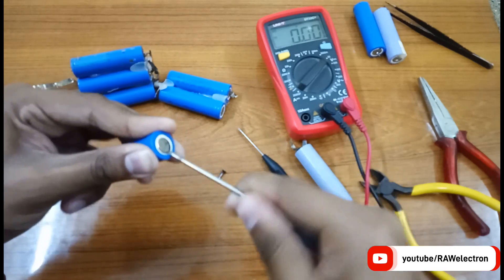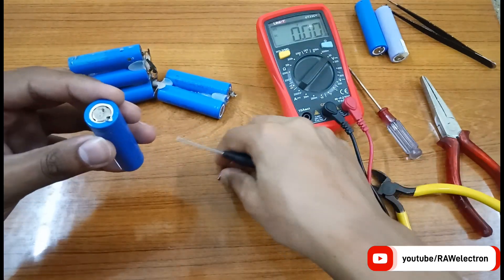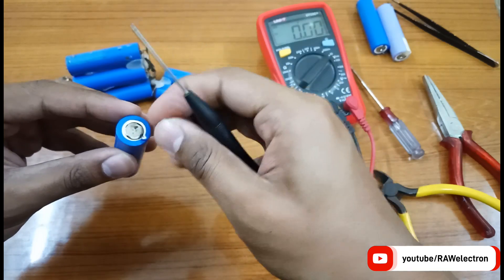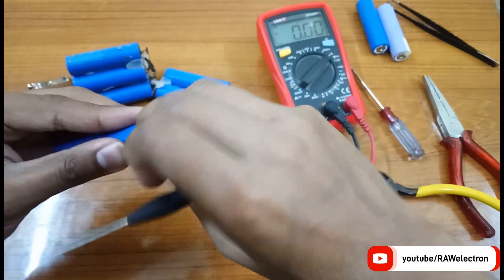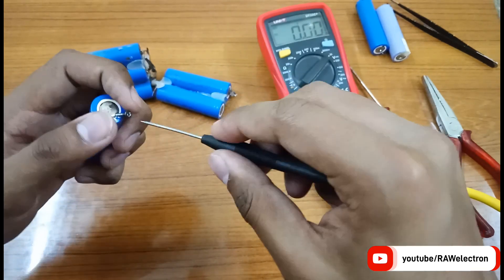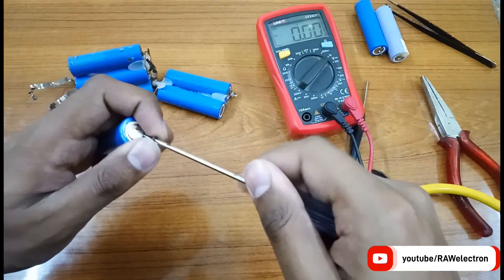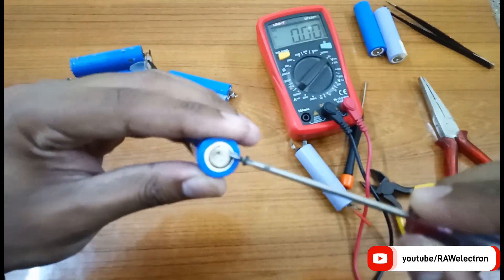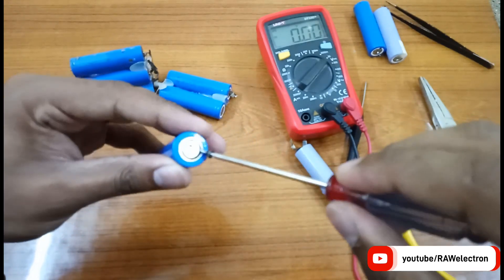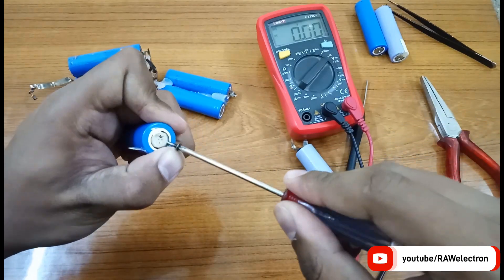Please keep in mind: there is no way to fix the internal chemistry of this cell if it is damaged internally — there is no way to fix it. I am only trying to close the circuit which was opened due to the gas buildup inside the gasket disc. After inserting the screw, tighten it — as you can hear, some gas has escaped from the shell.